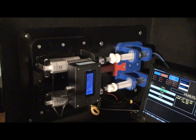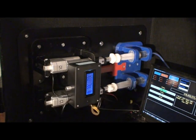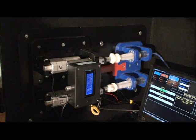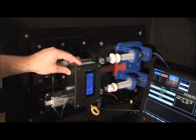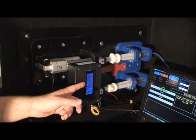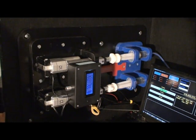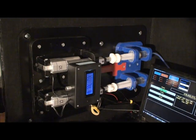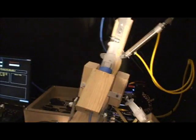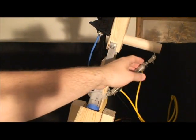So you get a pretty accurate system — probably within a tenth of an inch on the hydraulic piston, it'll stop. This is over USB and it connects to the computer right here. It's also in control of the valve. The air valve runs up to the hand and gives you an air system through this pneumatic piston, which gives you a high-five motion.